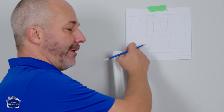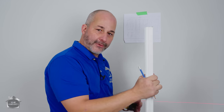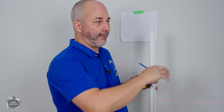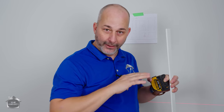We're going to use all of the exterior measurements, and here's the secret to the sauce: pre-paint the trim to the same color as the wall decoration. We're going to paint the wall, paint the trim, and then when it's all dry, cut and install it all. In the video we'll show all the cutting tricks to make sure every piece is exactly the same. We'll also show how to install so that when this wall moves and expands and contracts through the four seasons, we're not going to get gaps in all the caulking — something none of the videos I've seen online address.